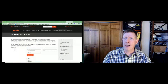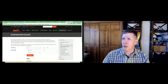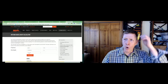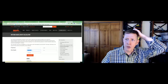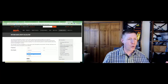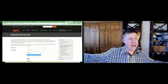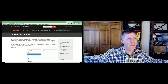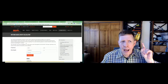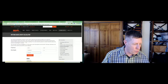Okay. Or if maybe we use 20 gigahertz, that full wave is going to be 1.5 centimeters. Okay, and you can use a full wave, so that's the actual length, or you can use a half or a quarter, not as optimum as the full wave, but also, you know, a 3 meter long antenna is a little bit much sometimes. Okay, but there's a calculator. I put it into chat. You can use that to figure out where you're at.